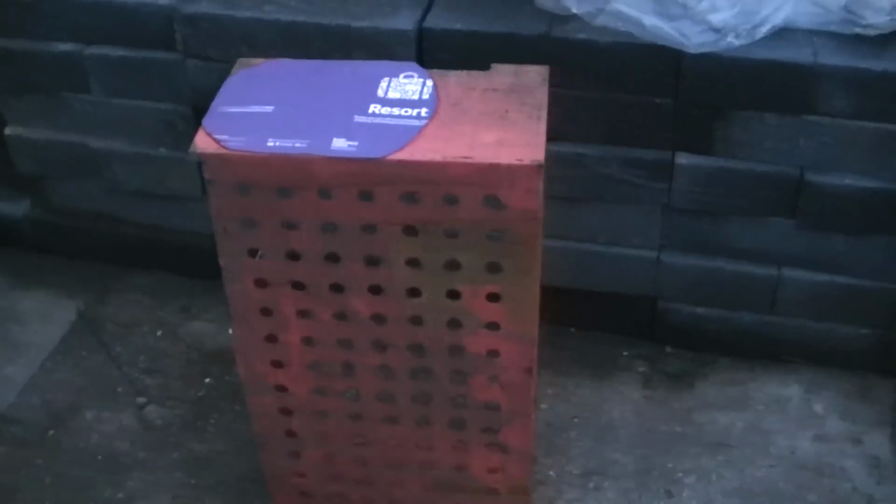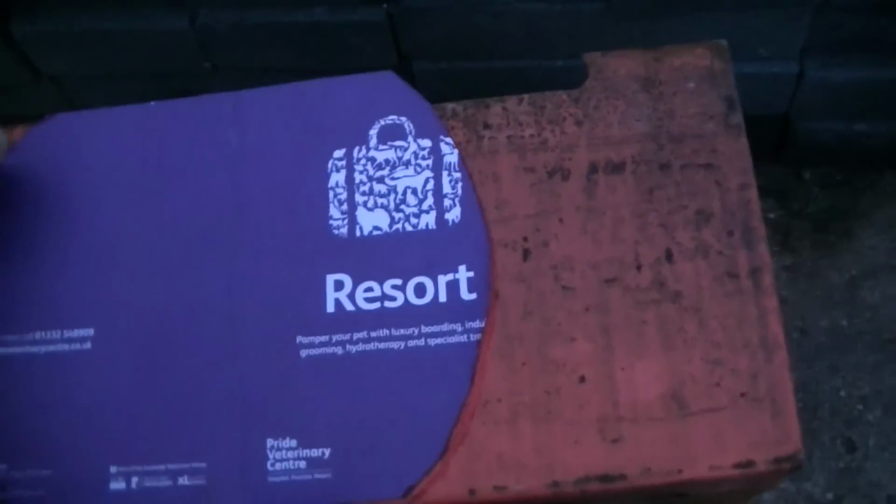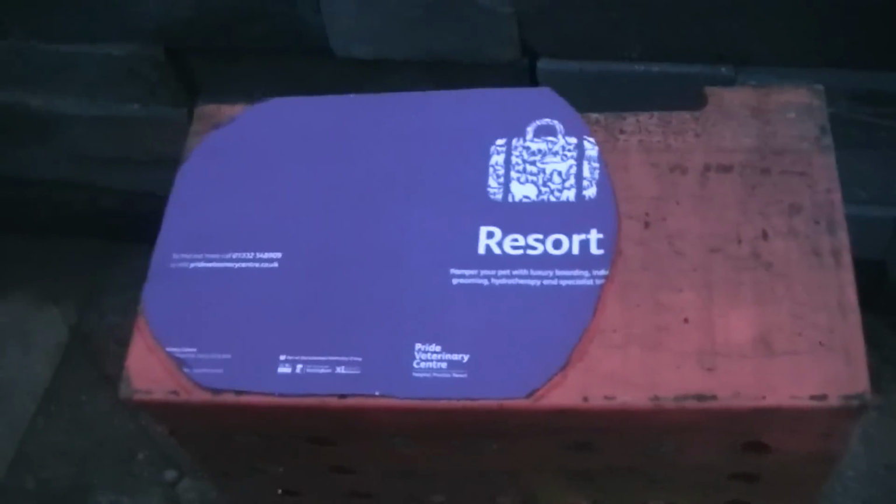Oh, hi guys again. I've got no idea how these videos are going to come out, but anyway, this is going to be the ash pan, obviously a template there. I'm going to cut that out with the angle grinder, and we'll see how it goes from there. Fortunately this is the only metal I've got. It was £3 from the scrapyard, I don't think that was bad. Also it's got holes in the bottom as well, so that'll do for the grid. It'll work good. And I need to weld some sides to this when I cut it out. And then the job will be a good one. Alright then, let me get to it.